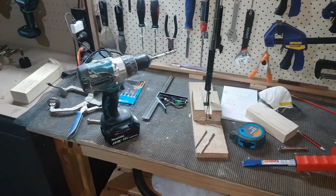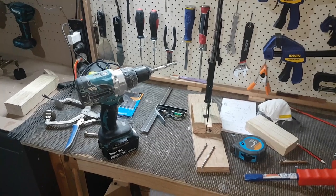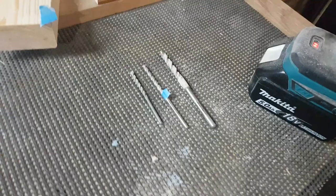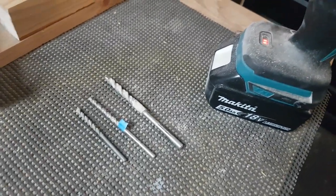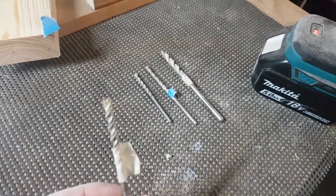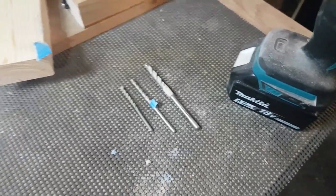I've got eight of them that I need to put in across the top. I'll take woodwork over masonry any day of the week - this is not fun, and the neighbors probably don't think so either. I've got the first four of the eight in the concrete drilled. I had to step through four different bit sizes to make my life easier and even so that took a long time. Managed to destroy a couple of bits - that little one in particular is completely tipped out. It was pretty tough reinforced concrete.